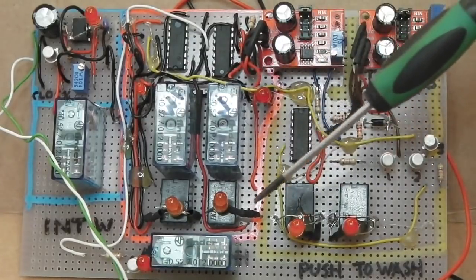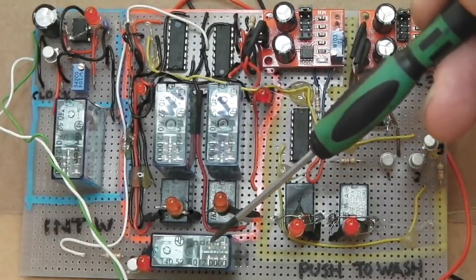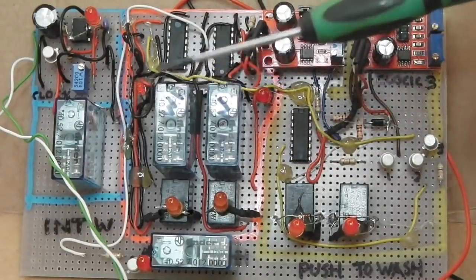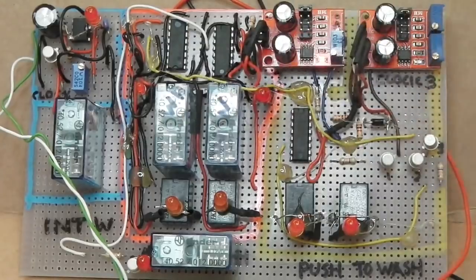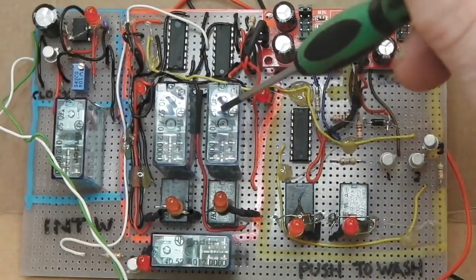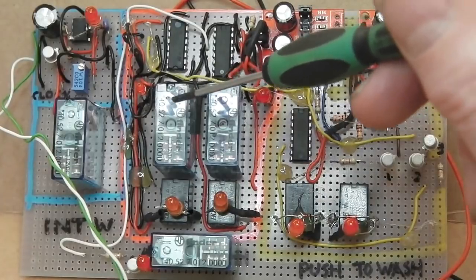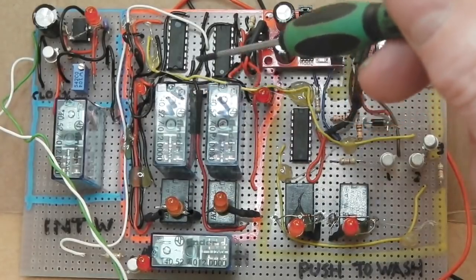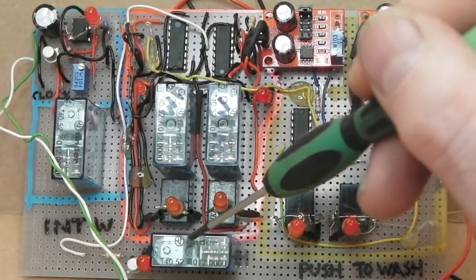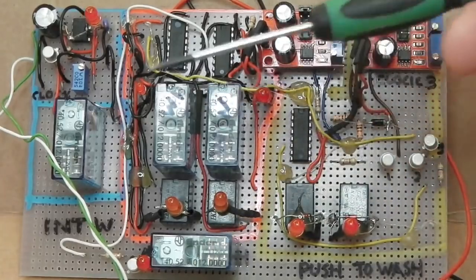That's all that does. And at the same time this is going on, it locks a relay on here, which is the arm relay for the rain sensing wiper. So I'll pull down on the stalk, which makes this ready to receive the signal. It'll then receive the signal because I'll press the washer pump. It'll then squirt twice, a short burst first, wait, burst again, post wipe after 4 or 5 seconds, I think I've set it for, and then of course this will lock on earlier on in the cycle so that the rain sensing wipers are actually armed and ready to be searching in case the washer jets spray up that far.